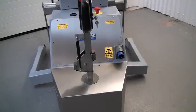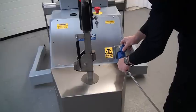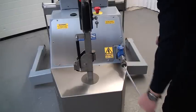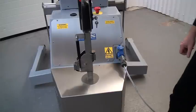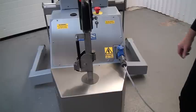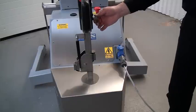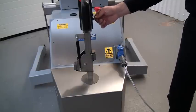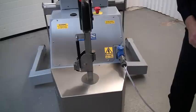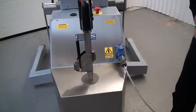To connect the mains power lead, take the lead, open up the end cap, place it onto the socket, and push it tight. When the unit is on charge, the charging light will be indicated and you cannot drive it while connected to the mains supply. If leaving the unit on charge, switch off the unit and remove the key to prevent anyone using it. Most importantly, this is a single operator unit and no one should be standing in front of the unit when it is being operated.